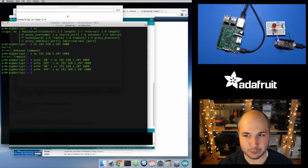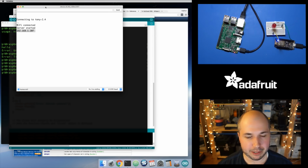to it? In the first video, I showed how to give the Raspberry Pi a static IP address. So it's one that's assigned to it, and it's fixed ahead of time. And that's a good option. You could do that. I'm pretty sure the ESP supports it. I haven't used it myself, but I'd be shocked if it didn't support setting a static IP address. But it's a little annoying, because you might have multiple ESP boards, and each one is going to need its own static IP. So I'll show you something pretty cool that you can use.